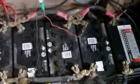Generally I think that paralleling batteries will give you far less problems than seriesing them, although seriesing and paralleling together may open up a whole new can of worms, but that's just what I've found. This battery bank's 12 volts, my deep cycles over here are 12 volts, and they've been augmented by these couple of second-hand car batteries for a while too, but they probably don't do much on this setup.